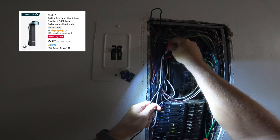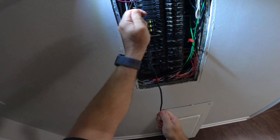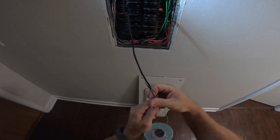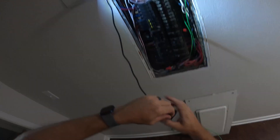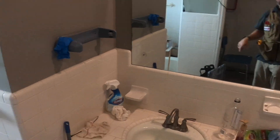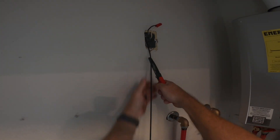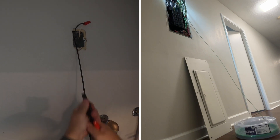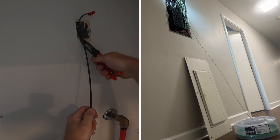That old arc flex light over there gives pretty good light for this kind of stuff with the angled head and magnet on the bottom. Finally got it to where I think I can pull it, so I made a loop hooking up my ground wire — getting those tied together. I thought it'd be an easy pull so I didn't go crazy getting it taped up. Now I'm pulling the black wire out that's hooked up to the green wire in my coil pack. Basically I'm just replacing a black conductor with a green conductor, so in my box I'll have a black, white, and green conductor for my 120 volt 20 amp receptacle.